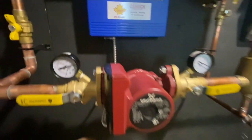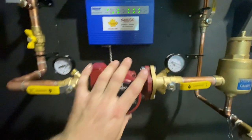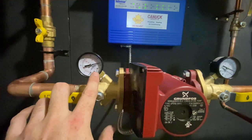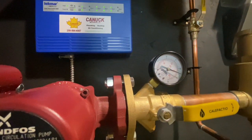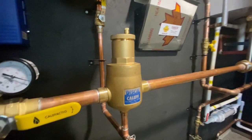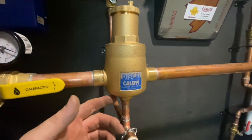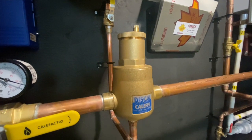This is our main circulator. When there's a call for heat, this zone controller will send power to this system pump or secondary pump and activate it. You can see pressure is a bit high right now just because we've been purging some air. We have a delta-P of about five PSI here, which quickly tells me if this pump is working - good for diagnosing. We put in a Caleffi micro bubble resorber, or air scoop - an air separator - and the system has been up and running for about half an hour and it is very, very silent. These things work and are worth the money.